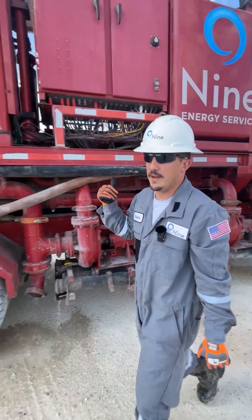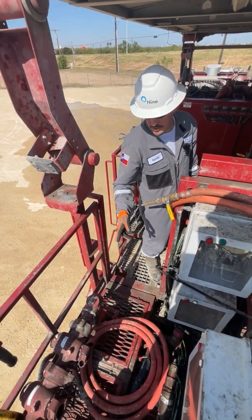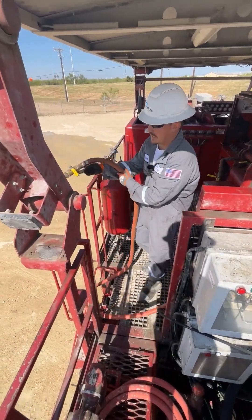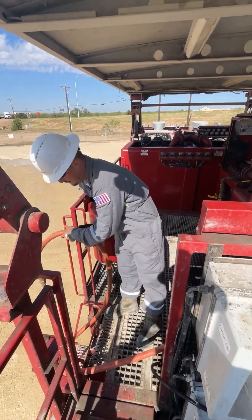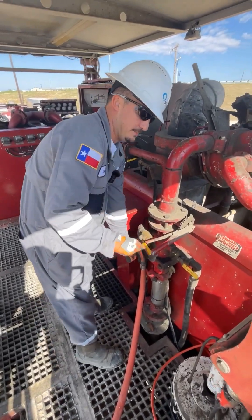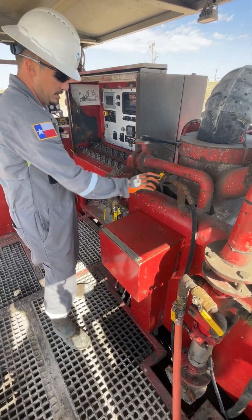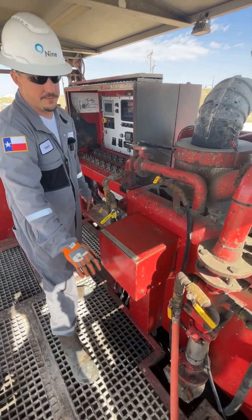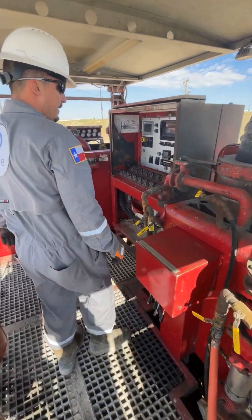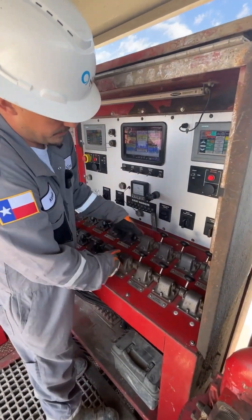Now we're ready to go up top and open all the air-actuated valves. You always want to verify your one-inches are open. We'll start off by dripping the red hose off the side of the pump and let it drain. We'll open all of our valves on our mixing system. Make sure you crack them back to half so no water gets behind them. We'll open all of our interior and exterior air-actuated valves.